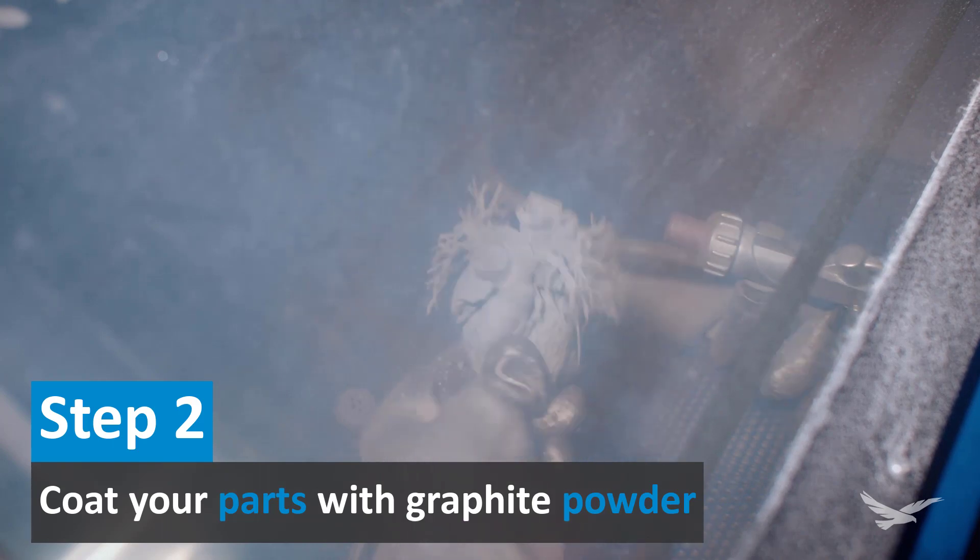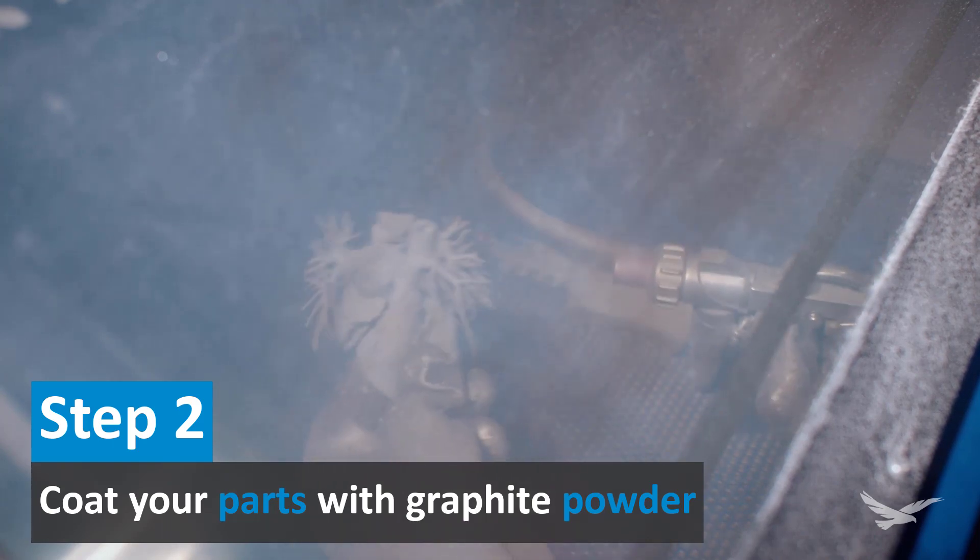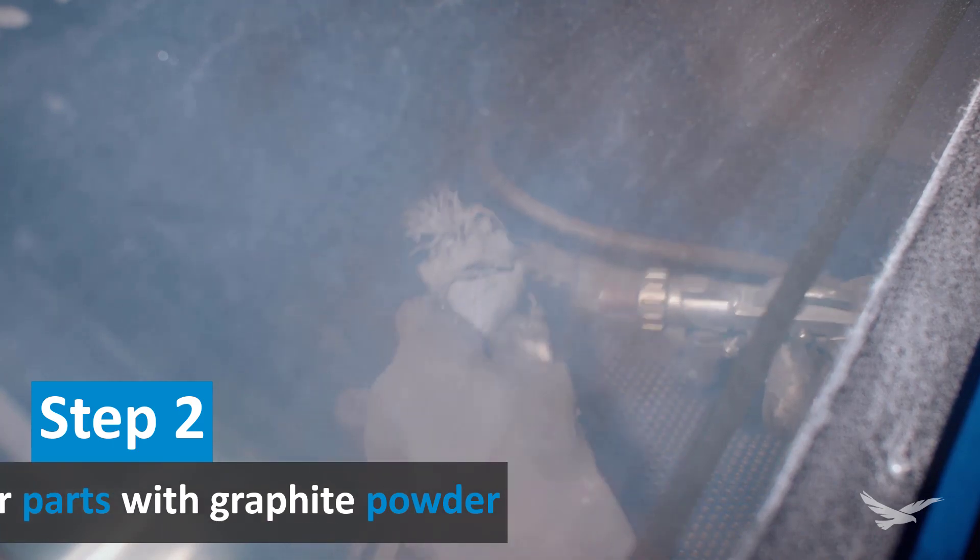As you can see, I'm using a model of a heart scan here, and the graphite media is not deforming or marring the small arteries and veins. This is also a generally quick process, typically needing a minute at most for many medium to large parts, but the longer you blast a part, the darker you can potentially make it.